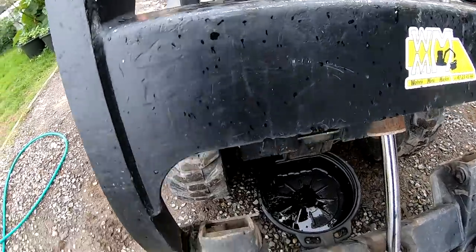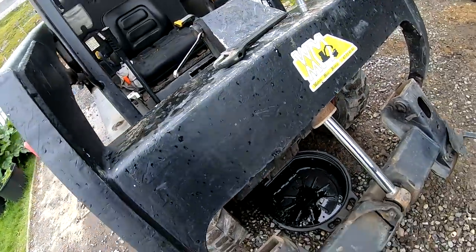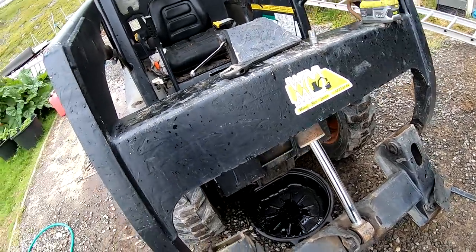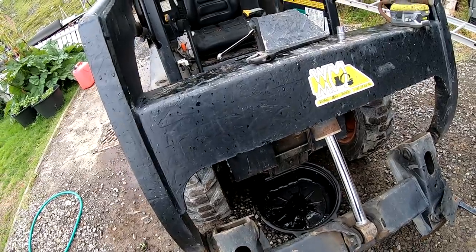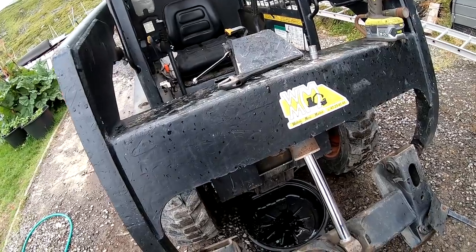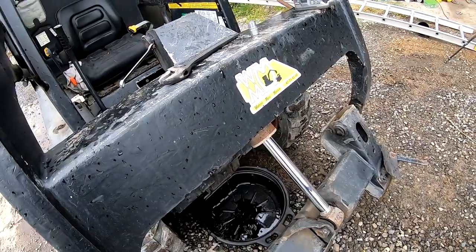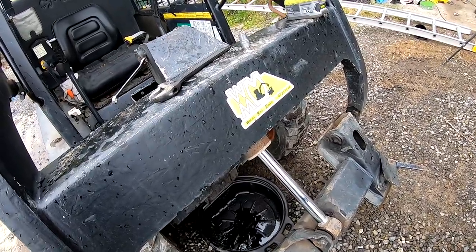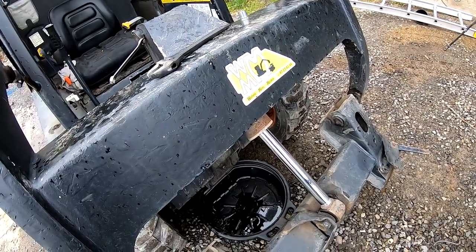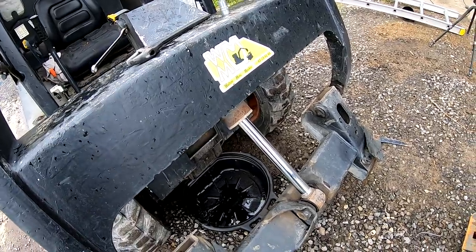Okay, so while draining the oil, I can smell that the oil is smelling a little bit strange, and I'm guessing that someone along the time has filled some hydraulic oil on this machine. And as I learned on the internet, they are not using hydraulic oil, they are using some engine oil, 10W40, same as old tractors do. So I think we will drain all the oil out also, and change that while we're at it. It doesn't smell good.